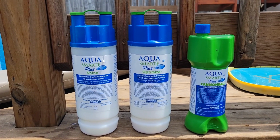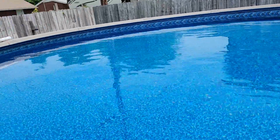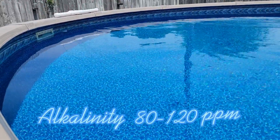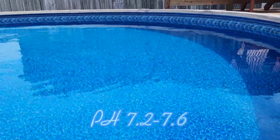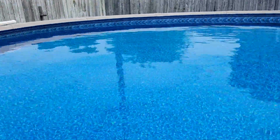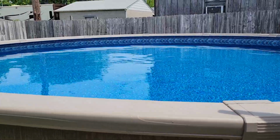I'm opening up the pool and today I'm going to show you how to go about opening your pool using the Aqua Smarte system. You have three things you have to put in. Don't put these things in until you get your pool water alkalinity and pH set correctly. Once your alkalinity is 80 to 120 parts per million and pH is from 7.2 to 7.6, once you get those waters stabilized, which is what I have just done. It took me about a day to do it since my levels were so low.